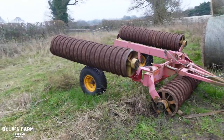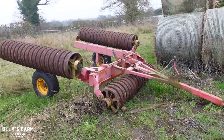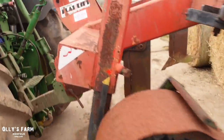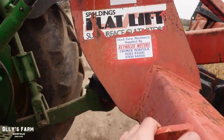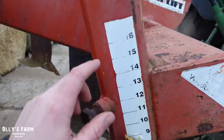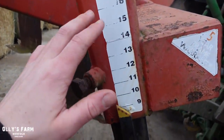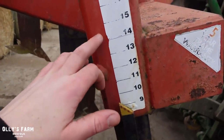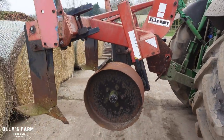So we're just going to have a look at the subsoiler. There's the rollers - they're just waiting for the hydraulic cylinder on that, just to finish getting those repaired. And on Monday I was carting some straw bales in, finished getting the rest of those. Also yesterday we went and picked this up, which is a Spalding's Flatlift subsoiler. We went on a little road trip up to North Norfolk to pick this up from Cromer, from a dealership called Reynolds Motors Cromer in Norfolk. They sell used machinery. There's a really nice chap there we met and he's helped us out with this. So I've just put it on the back this morning. We'll set it all up and take it in the field and see how we get on. We have got depth control just over here, so we can check how deep we want to go into the ground to crack the soil pan - which will be probably around 12 inches, but we'll go a little bit deeper just to compensate, so probably 14 inches. I've got a bar and a spade in the cab which I'll use to work it out.